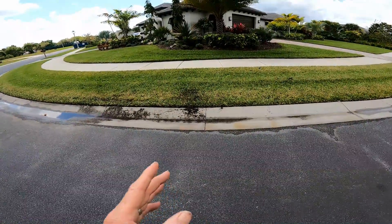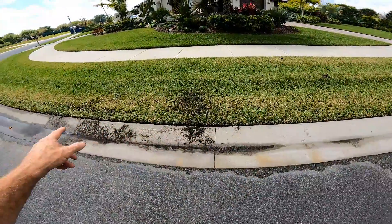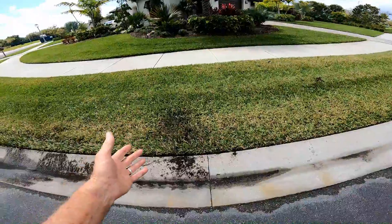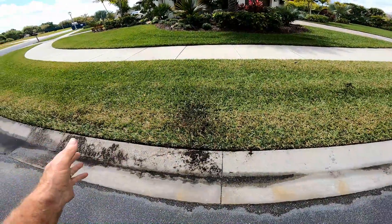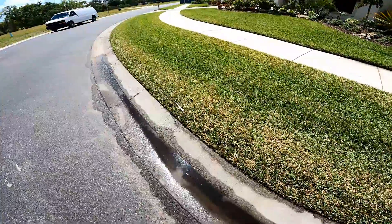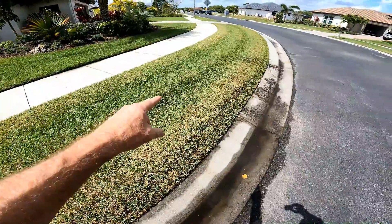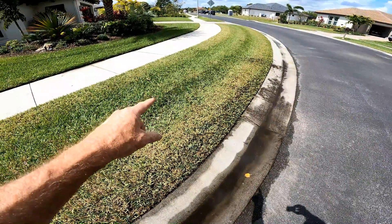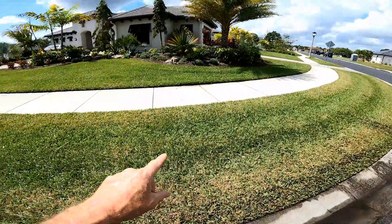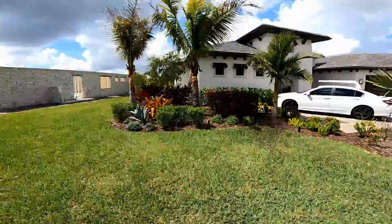We can't put a French drain in here — where would we send it? It starts 18 inches deep; where would you discharge that? You've seen us make V-cuts in this type of curb for the big four-inch pipe, but we can make a smaller cut and allow that water to escape. Right now it has no place to go at all, and you can see the whole area holds water.